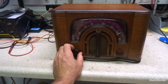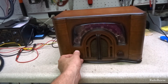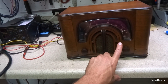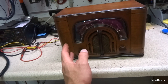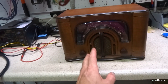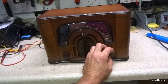It's all back together and working. We changed the chassis isolation cap — basically a line cap. However, it still motorboats with the tube I was using, so I found another tube it works with and we're going to ship it out like that. Somebody has changed quite a bit of stuff in this radio and there's a lot of sloppy work. The owner just wanted it working — he said it would shut off on him. I ran it for five or six hours and it's been fine, so we're shipping it back.